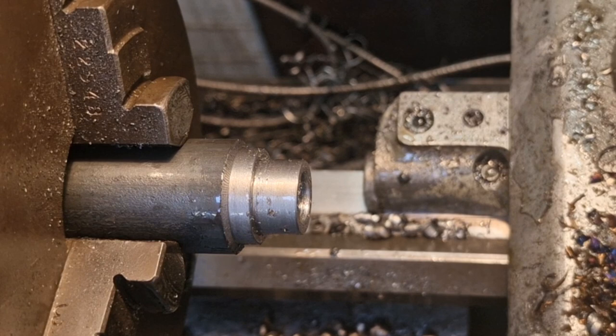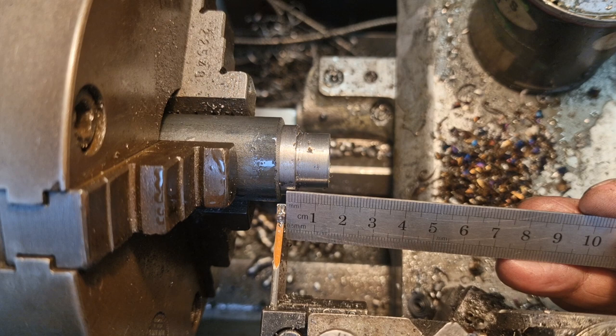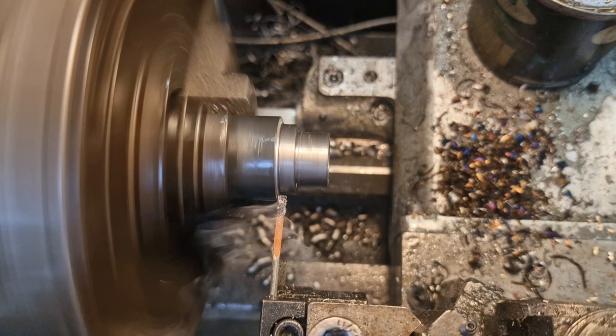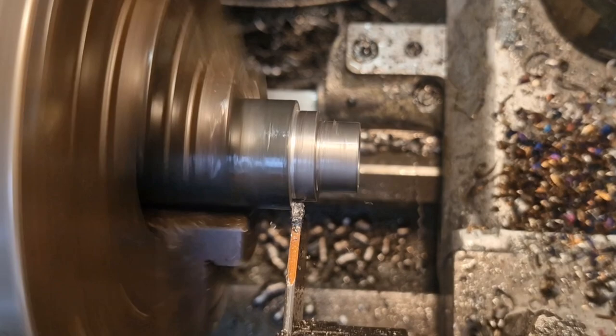We want 3 mil on the flange of where this is, which puts us there, according to my calculations. So, we'll just have that in. It can push the tool off to one side of it because it's not going in straight. So we'll just give a few in and outs just to get the ball rolling. And now we'll go for power feed mode and plenty of lube.